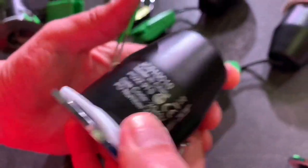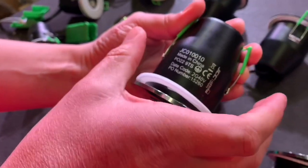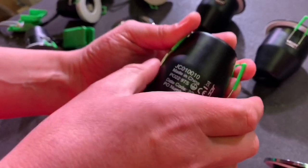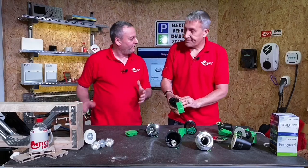The tapered design allows you to push the springs back past 180 degrees. So when you're putting it through the hole in the plasterboard, everything's nicely in line and you're not going to have to possibly damage the hole that you've just cut. That came from listening to electrician feedback.